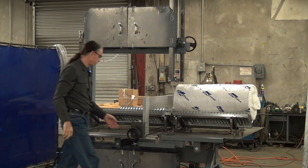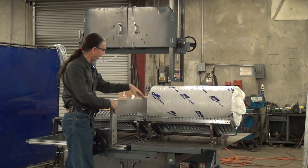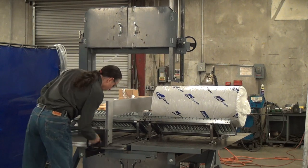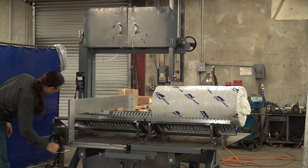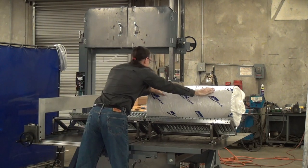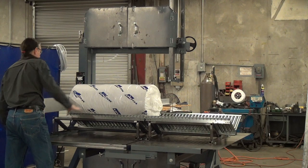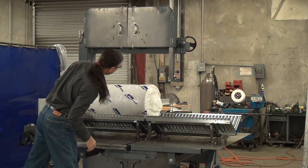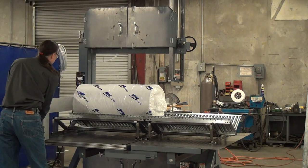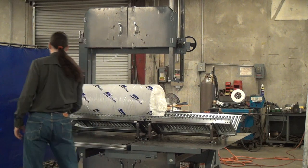The other way you can use this: after you've taken that cut out, you can run the work piece in to the fence again and make another cut. The other thing you could do is run the fence all the way to the end, move the work piece to the left of the blade, and then you can make a clean-up cut. Use the fence to slide the work piece across to whatever position. I'm going to do a minimum-material-loss clean-up cut so I get a straight edge.